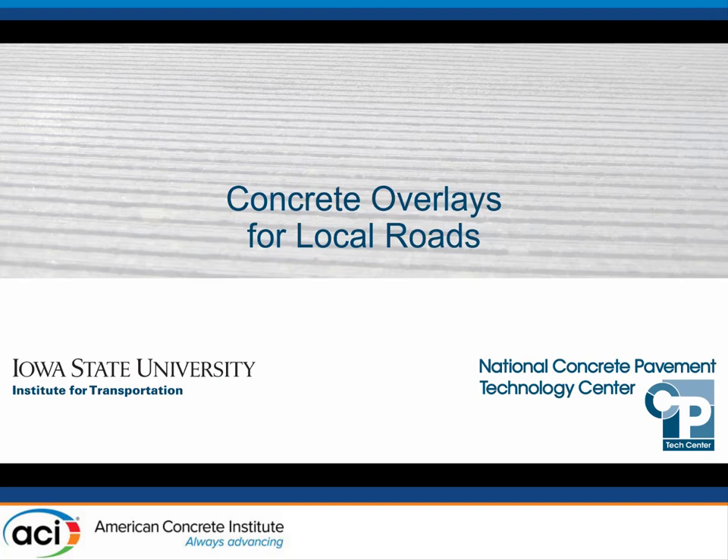We've talked about pavements as a whole and design. What Brian's asked me to cover here is the idea of putting overlays down, with a special emphasis on local roads. That does get a little challenging — putting an extra four to six inches of concrete in the middle of a cornfield is easy because the sky is literally the limit. But in urban settings, you're dealing with bridges, intersections, driveways, curbs, and manholes. Technically we can do it, but it requires a bit of effort.